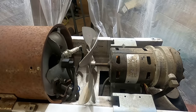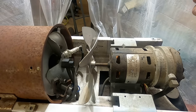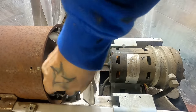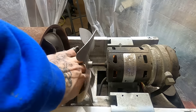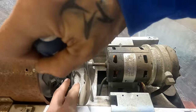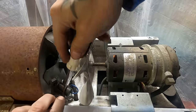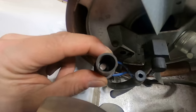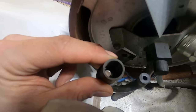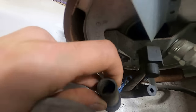Here are some of the issues you can have. First of all, everything can be dirty. If it won't turn on at all, or it turns on for a split second and kicks off, try your CAD cell. Using the flat-head side of your screwdriver, it's just a rubber boot held into this bracket — pop it out, work it around these lines. I can tell this has been maintained because the lines were not run in their OEM configuration. All right, I know it's hard to see down in the photo cell — it kind of looks like a little solar panel. Just wipe that off. Put a little alcohol on a shop rag, stick it down there, wipe it off, and put this thing back in.